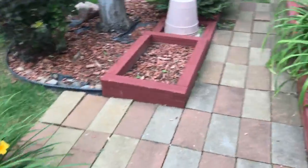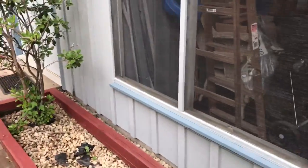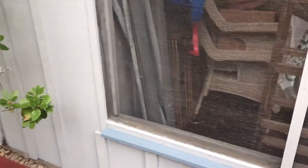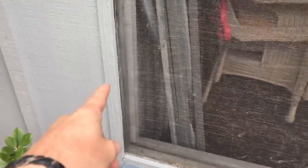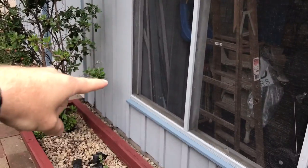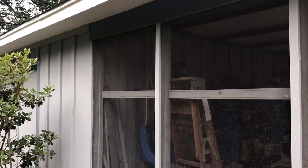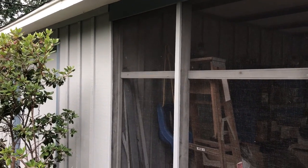So what takes us so long to replace and repair this mesh? In the Florida version, you just take out a spline groove that's along the edge and just rip the screen out, and then you start in with a new piece of screen and you're splining it in. You're able to start at the top, spline that in, and then spline down the sides and finish at the bottom. That takes probably about 10 minutes to do for one panel.